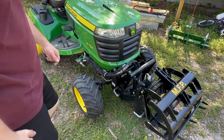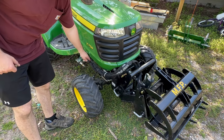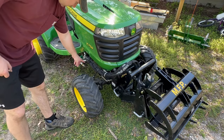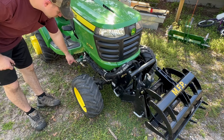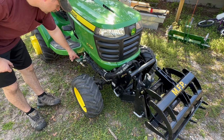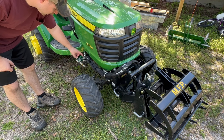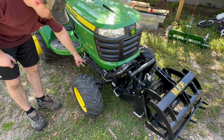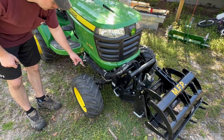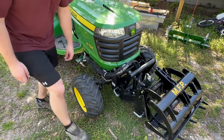Okay, so I washed my hands, then off camera, I put my little Velcro straps around here. I like tying these together to keep that away from the hood. That way it's not rubbing on the hood, scratching the hood up or anything. And then it also keeps things like this tied out. So the green and the black, I usually have to tie them up because they can't run through here because of how far out they have to bend to go on with this auxiliary rear hydraulic kit. So they need to hang down outside of that, so the Velcro just holds it up out of the way. That way the tire can turn completely and not be rubbing on any of this. So yeah, little Velcro straps there help out a lot, keep everything together and looking nice.